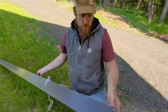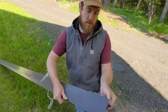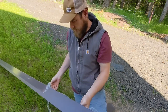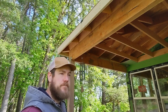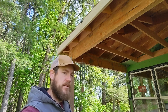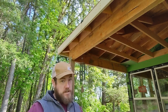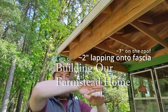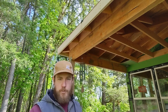So the first thing I'm going to share with you: every metal I've worked with comes with a protective wrap, and there's a complex profile here — you can see that — and this wrap is going to protect the whole viewable surface. The installation instructions from Taylor specify that your underlayment should lap over the top of the drip edge I'm about to install, but also over the edge underneath, so you cut it and it sits on top, comes down near the edge, and underneath there also needs to be a nine-inch strip of underlayment. Then you have your gutter and the hook edge goes over top of that, creating a super lap pattern.